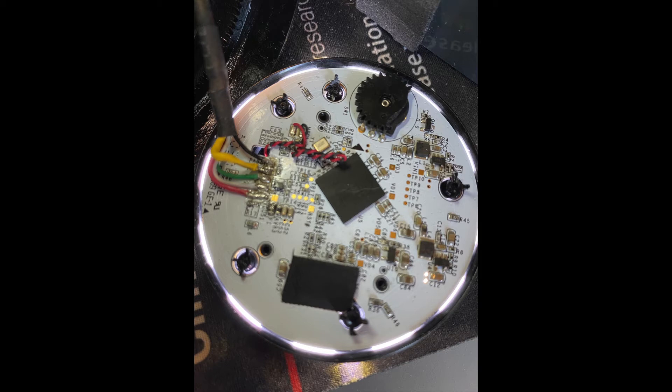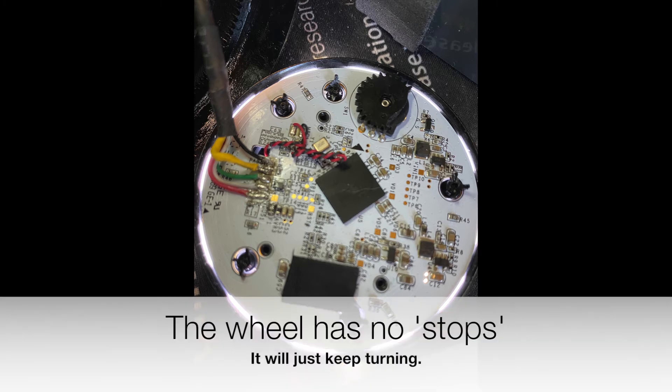White, green, yellow, black, red — those wires are all soldered in the correct position. What I'd recommend is turning the potentiometer so its gears are not facing the outer ring. In other words, when you turn the outer ring, the potentiometer will not turn. Adjust it to maximum brightness first, then keep turning so the potentiometer gear set will not engage the outer ring, keeping brightness stuck on bright.